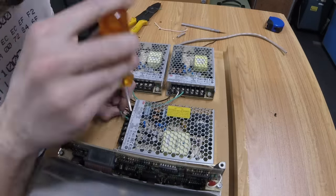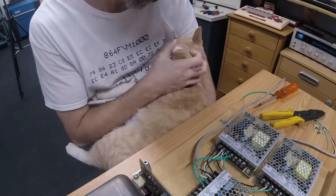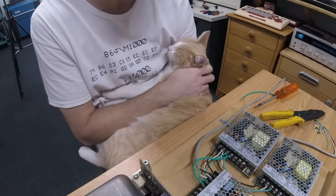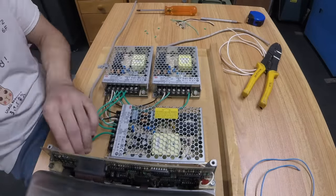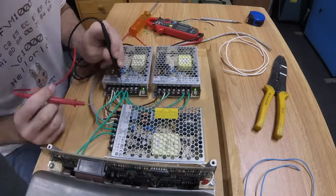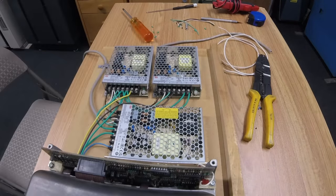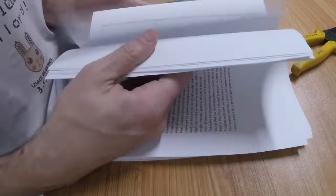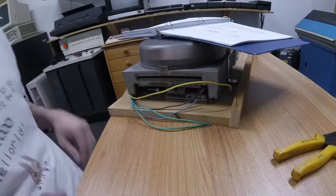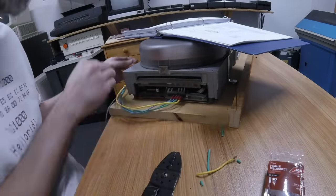This is probably one of the more tedious parts of the job, but it's also one of my favorites — just so therapeutic to get all the wires routed. Wiring up these Mean Wells is relatively simple; they can be connected in series or parallel without any worries and they're just great little hobby supplies. I had to dig through my printouts to ultimately find the pinout of the power connector on the back of the drive, then it was just crimping up little spade connectors and plugging them in.